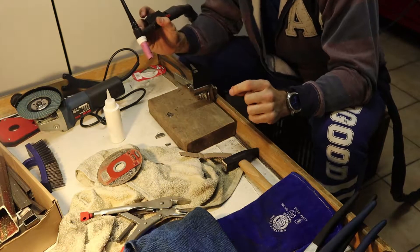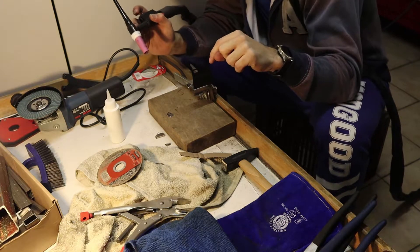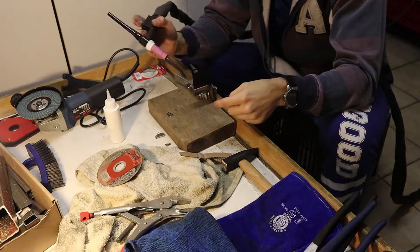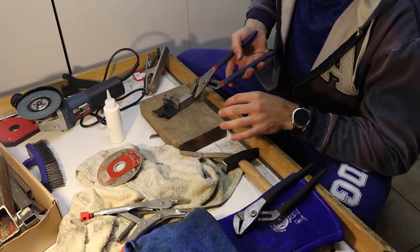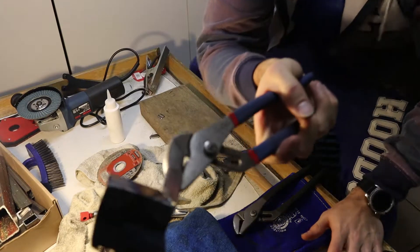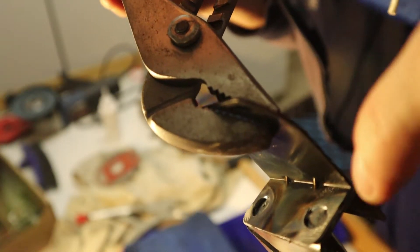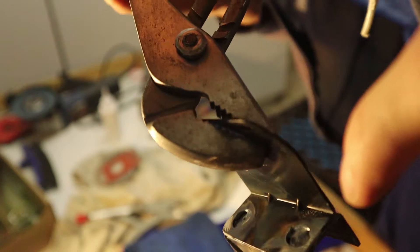What I'm doing here is welding through the hole that originally came in the bracket and then melting that towards the bracket that we've made. Just be careful — it's going to be extremely hot. So there you might get some idea of the technique I used, sort of like a spot weld or a filler weld.